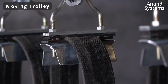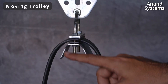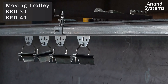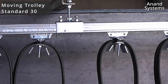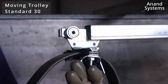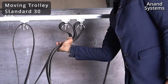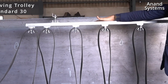The cable is properly attached between the rubber pads and we have a U-clamp to give the proper shape to the wire. It has two rubber grommets on the side so that when two trolleys collide the rubber grommets are colliding with each other. In the standard 30 series moving trolley, there is no movable bolt and movable stud, so if there is a horizontal force on the cables, the entire load is coming on the bearings and on the rail.